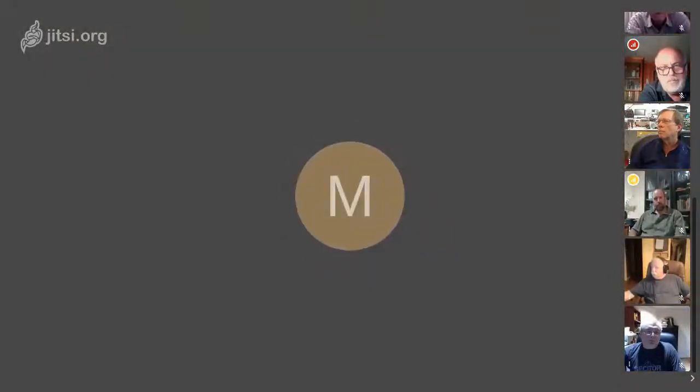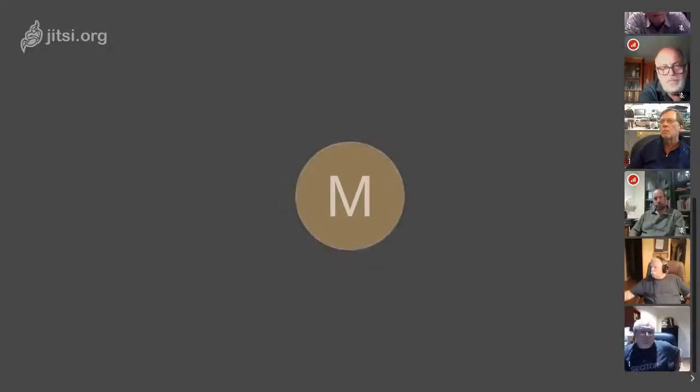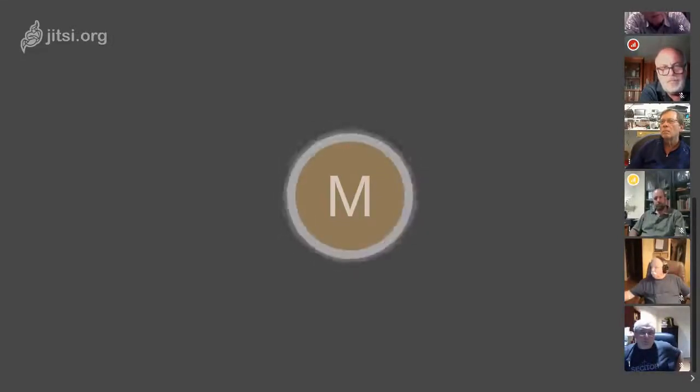Yeah, so this one works by linear loading. It's got a funny pattern. It goes out and comes back in and then goes out again. So there's something funny going on. Look at Bob Morton's Maple Leaf Communications 8040 shorty. He uses linear loading and he does have a coil in there as well. That'll give you an idea. It's a dipole, it's linearly loaded. It's shorter. It's for 80 meters and 40 meters, and it's about 60 feet long. Look at his diagram on the web.